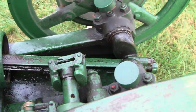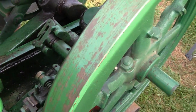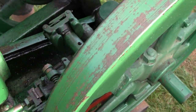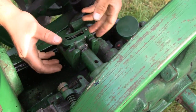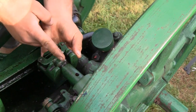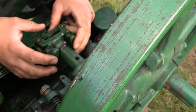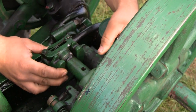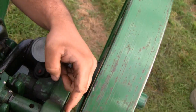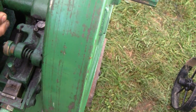As the engine's rotating, the governor rotates. As the engine rotates, centrifugal force opens these weights up. And there's a rod that runs through the center of the spindle here, like an axle. Come over here and you can see the rod pushes a lever - it comes out there as the weights fly out. You see the lever moving?